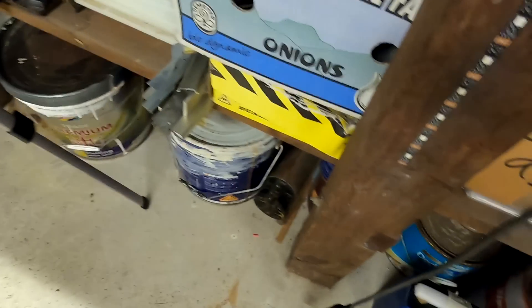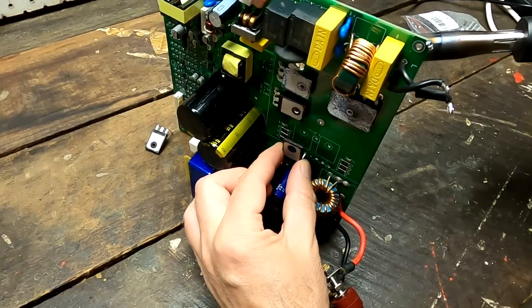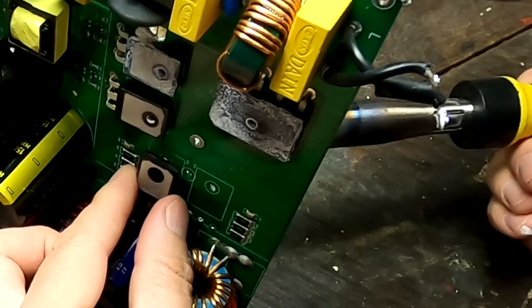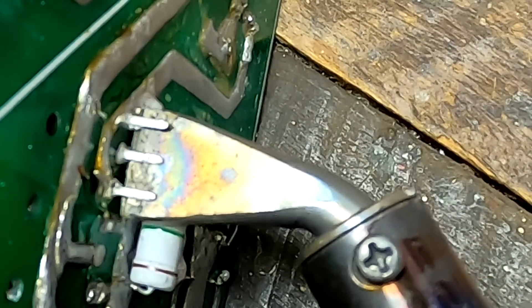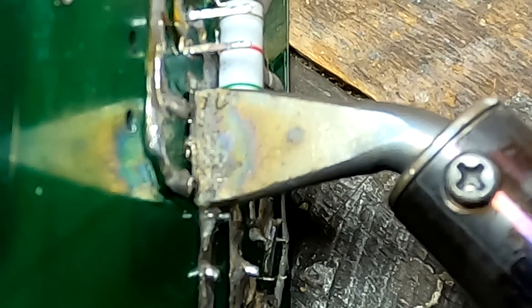The iron is hot enough - you can see it glowing. Let me turn off the light so you can see it glowing in the dark. They get really, really hot - usually made for soldering gutters, train tracks, ships - or apparently a fast-acting recovery diode on a PCB. There we go - is that easy? You're applying heat for not even a second because it's so incredibly hot. Bang, it's in - all three pins at the same time.